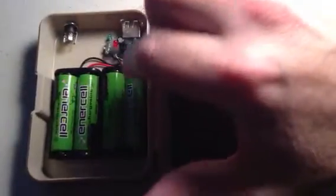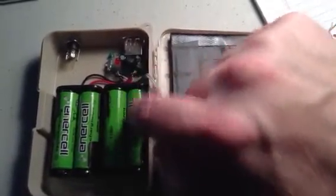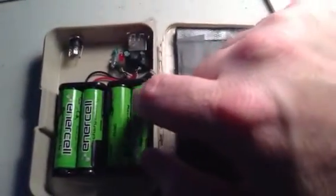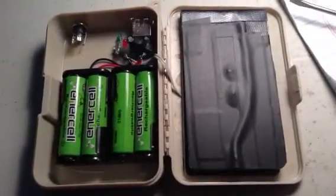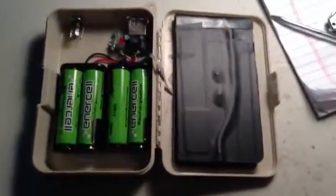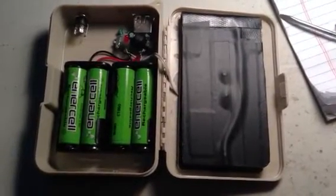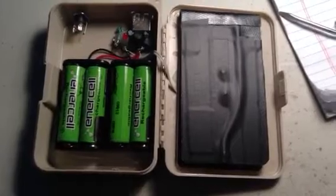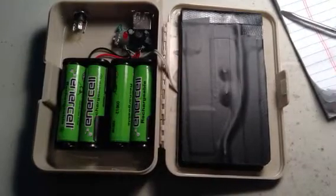I always check the voltage. This is 2.4 volts with these in series, so you can check positive here, negative here, and see what you're getting. Just one battery when it's fully charged is usually about 1.48 volts — that's what a regular wall charger brought it up to. So that's what I feel safe charging up to with solar power, stopping at about 1.48 volts.